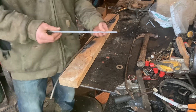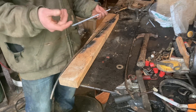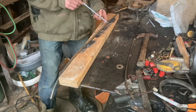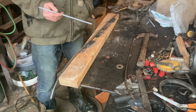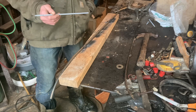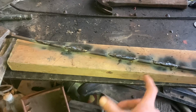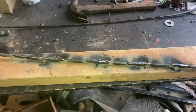One last thing I'm going to do is use these hard surfacing welding rods. I got these at our local supplier — I don't know exactly what brand they are — but I'm just going to run a couple of beads down the length of this, and it's going to act like carbides, so I should get a longer life out of them. We put these on plow points and it really helps with their life. One thing to note: you don't want to go the entire length and fill it up completely. I left spaces so there are still flexible areas in it, allowing us to actually bend and get it into our ski.